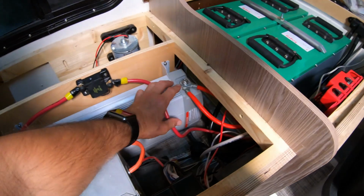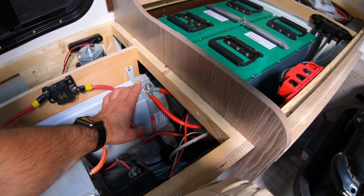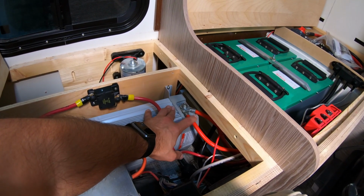I did order this on Amazon. It's a Young Marine 70 amp breaker, which is actually less than what the inverter is capable of handling. It's going to give me about a total of 900 watts before that'll trip, which is fine with me. I have no intention of maxing that inverter out. The DC positive cable was delayed in shipping for the inverter. So it's either 4 or 6 gauge cables. Because I need one extra cable, I'll use one of these as the extra cable that I need.